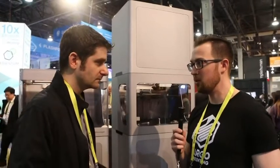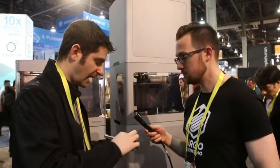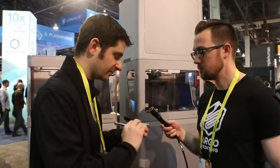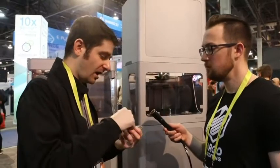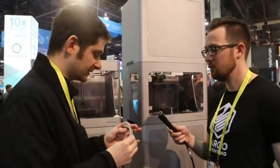With metal 3D printing you're able to do internal channels. One of the unique things about this new process is that this entire brake lever is hollow — we can actually create a honeycomb pattern and print over it, which is not something you can do in a powder bed process. In a powder bed, the part would be full of unmelted powder — you'd have the weight but no strength. Because we're depositing material in air, you can make these hollow sections that are printed over. This is like 50% air, making it 50% lighter, with less material cost and faster printing.